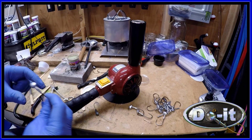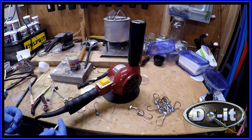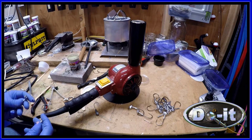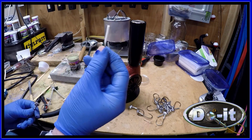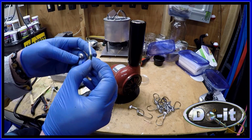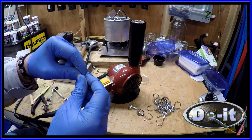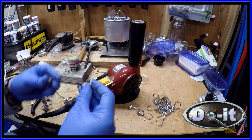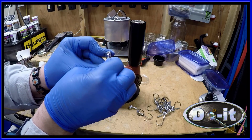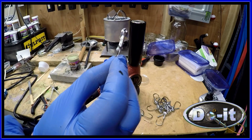It's time to start painting. So I have the oven preheated at 350 degrees. So once I powder coat these, I put them in the oven for about 20 minutes. So I use another different type of weed guard pin here, and this is the Teflon. The reason I use the Teflon is because the paint can come off of it a lot easier than the metal ones. So the reason you want to use the Teflon pin is you put it right where the weed guard goes, so when you paint it, no paint gets in the hole.